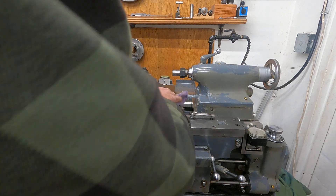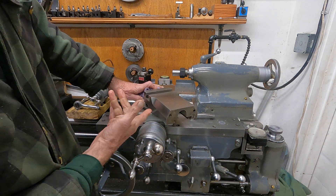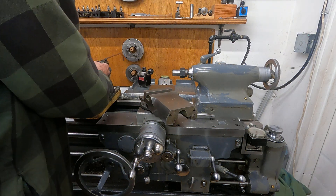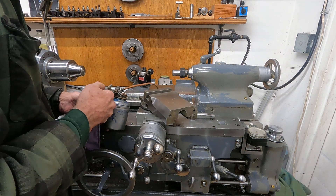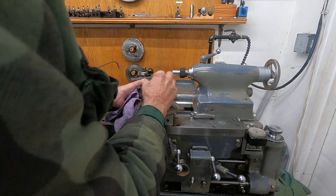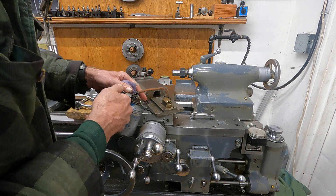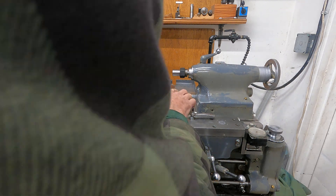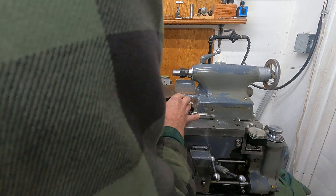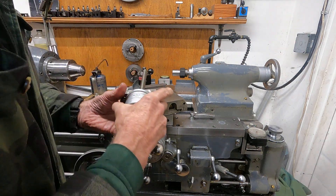Just wipe this down and bring it back. To remove the knob you have to get underneath and use one of those pin wrenches. I've got it wiped off in the front — put a bunch of way oil here on the front, lots of oil — push it forward again but not all the way off. You don't want to come off that gib; about that far is good enough. Wipe that off, oil it, bring it back, move it back and forth — you can feel how nice it is. This is precision made, very very nice. You have to do this because oil gets sticky, so if you want to cut screw threads you want this working right.